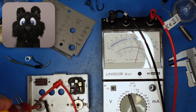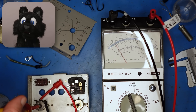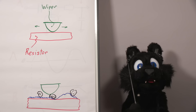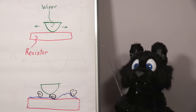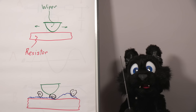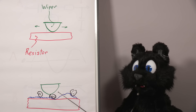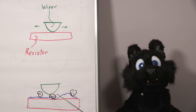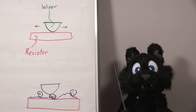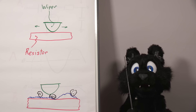I'll use this opportunity to also show how I check the potentiometers. I use an analog meter for that. Why? Other than nostalgia, there is a deeper reason behind that. Potentiometers, or rheostats, work by sliding a pickup contact across a resistor surface. There are various ways to construct these components, but that basic concept is universally the same. Over time, a layer of dirt or oxide forms on the material and gets trapped between the wiper and resistor. That layer is anything but even, and so the wiper will lose contact when particles are trapped under it. This is why old radios crackle when you adjust the volume.